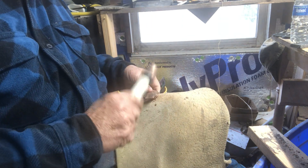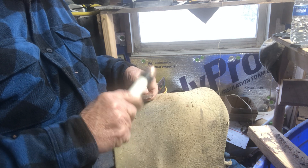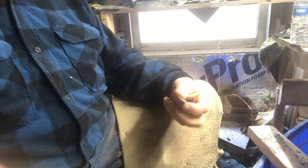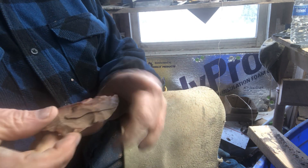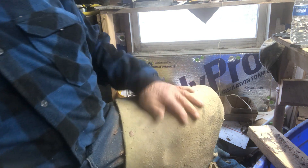I'm going to come through here and try to run a flute down the middle — not make a clover side or anything like that. I'm just trying to stay in the base, and the best way to do it — you'll lose some width — is to just come down the middle like here, run a flute down it just like this, and it's off in the base. That one's ready to go.